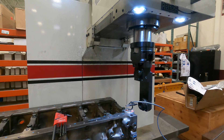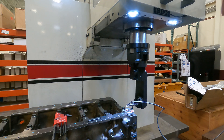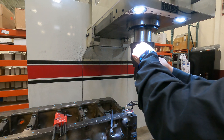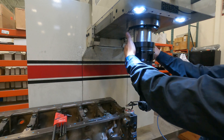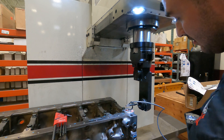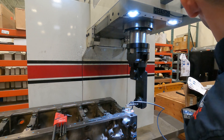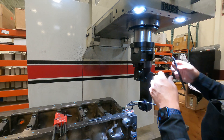I like to put a little tension on this and sweep, then adjust some more. You want to be patient with this — it takes a few tries to get used to it. As you tighten this, it's not uncommon to see it moving kind of up and down. So just do it in increments, keep checking, and be patient. As long as you keep checking as you're tightening, it should stay even side to side. I got about two tenths on my MagnaScale, so we're going to call that as good as we're going to get it.